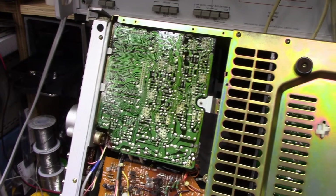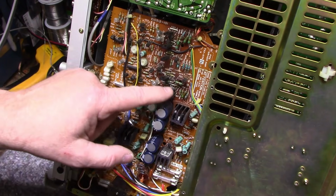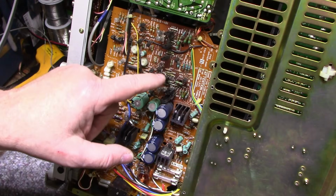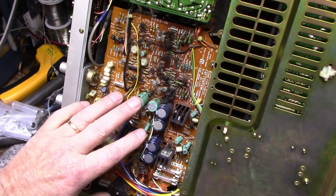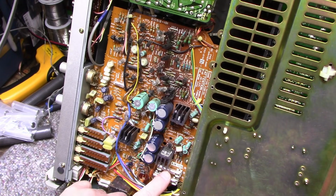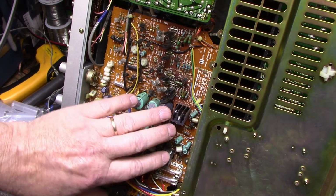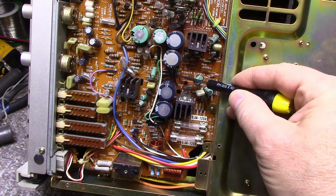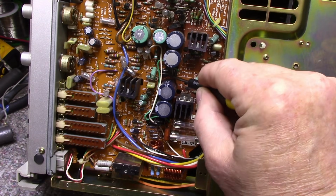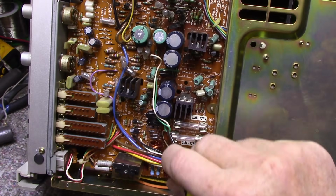This one here on the bottom, this is a different story. Got a lot of heat zone right here. And I was looking on the other side, and we have a lot of cracked transistor leads and stuff like that. They're all cracking because of the heat. This is all power supply down here. Some fusing. And we have relay, speakers relay down here. And then we have power supply here. This looks like the regulators. And lots of black stuff oozed out on the board. You can see in the shadow here, but this board is all stained with black. Right there's a big spot.